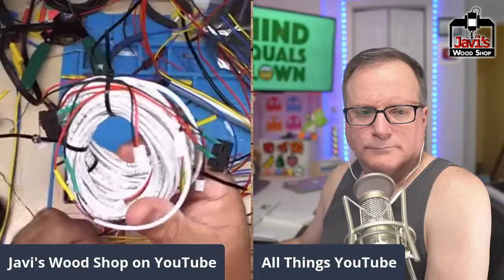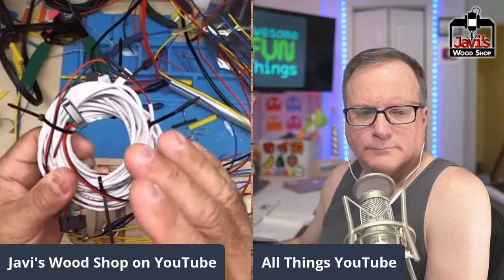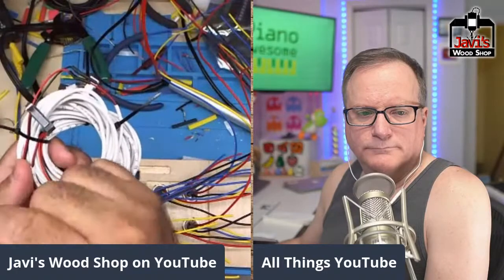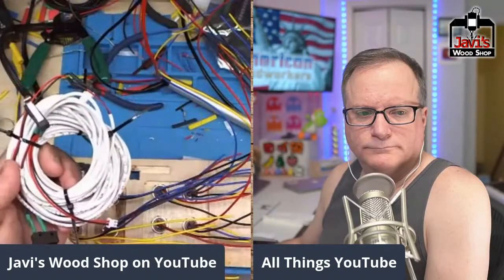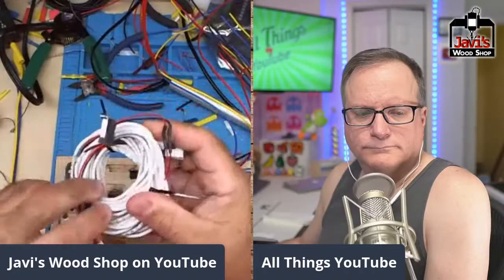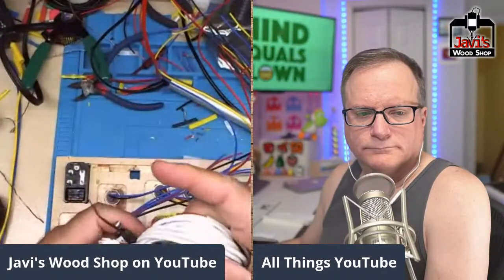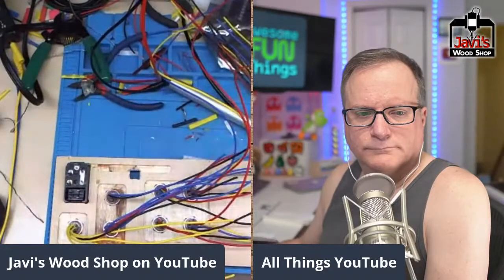And so, what you have in the bundle that I send out is a 12-foot, a 6-foot, a 12-foot, and another 12-foot. The 6-foot is from your box to the y-axis, and then the 12-foot is from the y-axis motor, to the x-axis limit, and then the next one goes through the drag chain up to the z, and they connect to each other. You'll see they have a male to female, male to female, male to female, and then the last male on the end of the 6-foot connects straight to the JaviBox, to switch input number 2. And I hope that answers your question, Mike?